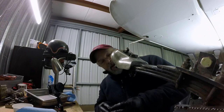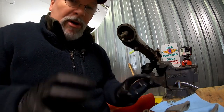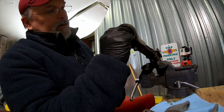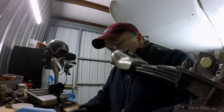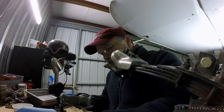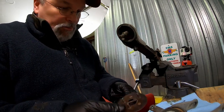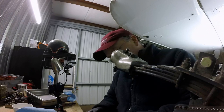Wanted to show you what all parts need to take apart and how to get this apart into the individual pieces to clean it. So there's a friction plate that will be up underneath here. We pull that out, clean it. You should have, for a Stinson, all five of your little springs in here, okay? The plate originally only, some of these only originally came with three springs, and those springs were on these posts.